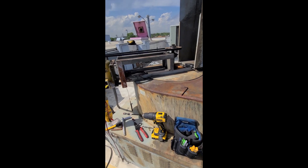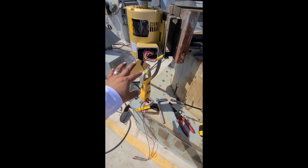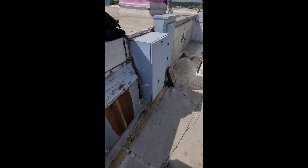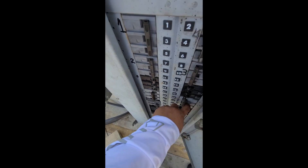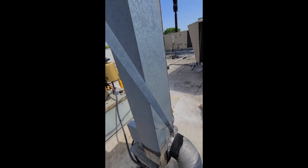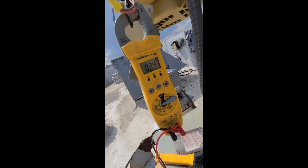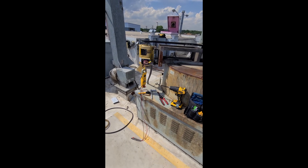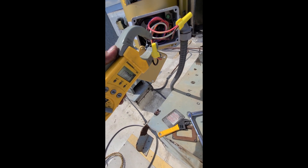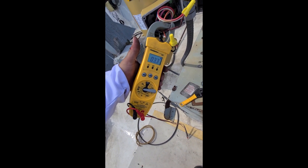Getting ready to fire this up — I'm going to take some amp draws and make sure I'm under the rated load amps so I don't burn up this motor. I've got my meter on amps clamped around one phase, leaving the other phase accessible. I think it might be a bit tight. Here we go — one, two, three. Let's go check our amp draw. They're going to be very happy when they feel the air. I got 3.5 amps. You want to wait for it to ramp up fully — it needs to be under 4.4. Next leg on the second wire: 3.3 amps.